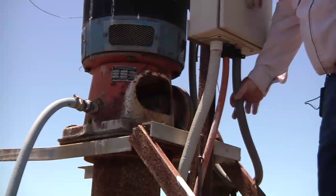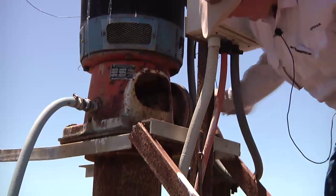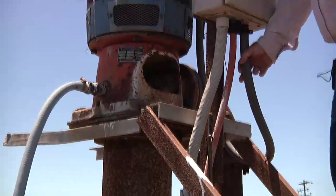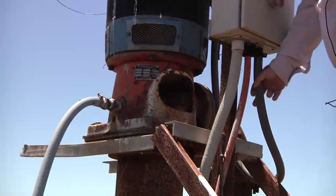If you've got sediment build up around the packing gland inside there, you could wear the shaft out. I can see looking in here that there are some deposits of sediment. If you were to run this pump before you cleared that, it would grind away on that shaft.